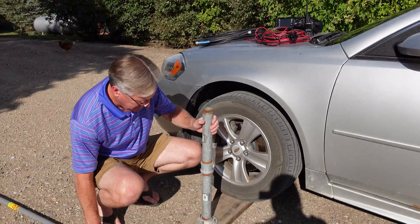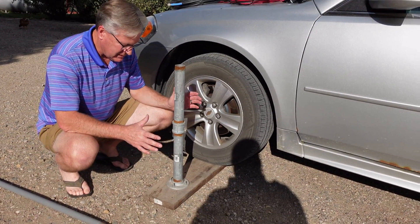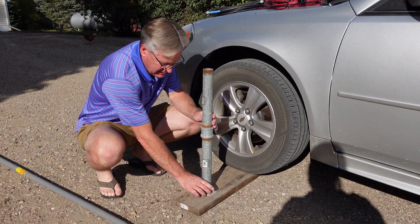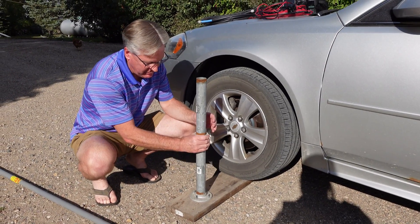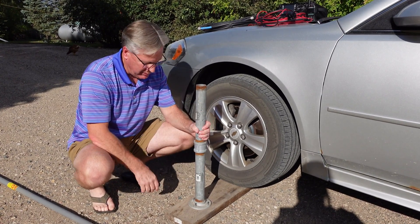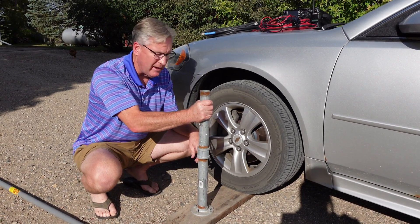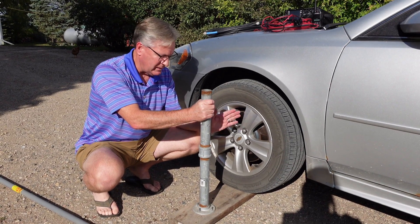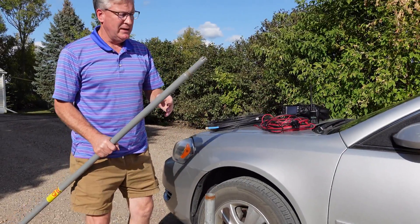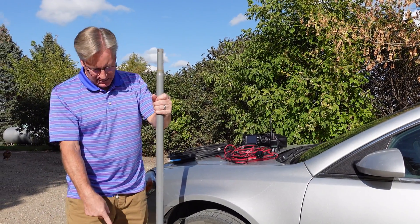I want to show you a couple of things for setting up antennas. One of them is this run-over, pull-over antenna support. It's nothing more than a 2x8 board where I've taken a plumbing nipple and put a piece of heavy-duty pipe with another nipple and another piece. This is about 2 feet tall of conduit, and I've bolted three bolts through it. This is seriously heavy-duty — when I run my tire over it and the car's weight is on it, this is sturdy. It's so easy to bring a few of these 5-foot mast sections along — smaller end, larger end, they fit right inside each other.